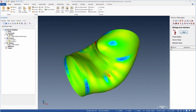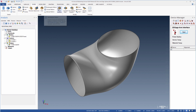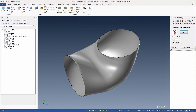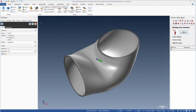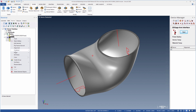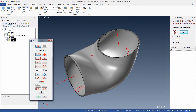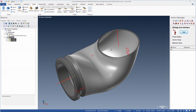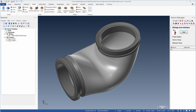The downpipe surface looks correct, so we'll use the solids commands first to create a solid from the surface thickness, and then to thicken the solid so it represents the actual material thickness. To create the flanges, we'll first export the measured cross sections to CAD — these were captured using the portable arm probe when the pipe was scanned — and then use the solids revolve command to create flanges at both ends. We now have a solid model that we can use for CNC machining, flow analysis, reverse engineering, and inspection.